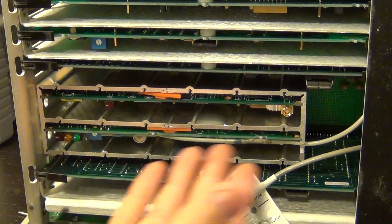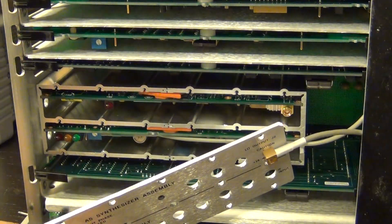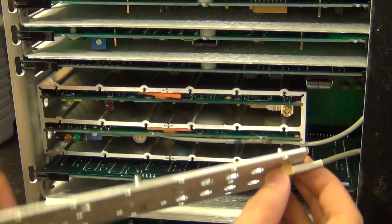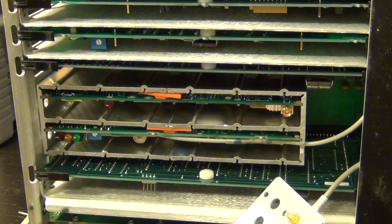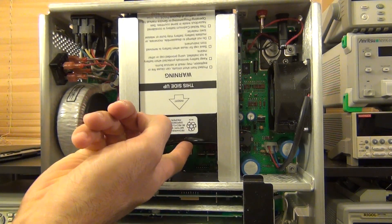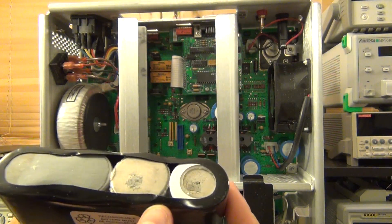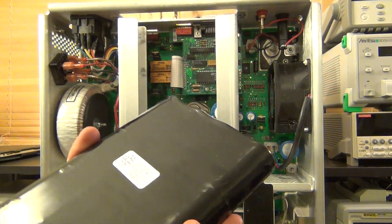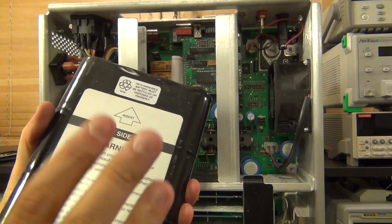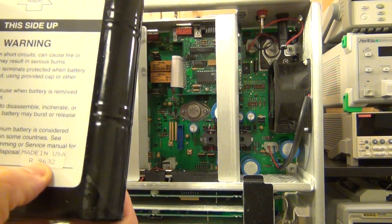The output of the VCO comes out here, goes into this IC — which is a differential pair — splitting the signal into two. One signal comes out here, goes into this amplifier which was that final stage with a heatsink, and the output goes out as the synthesizer output. The other side of the differential pair feeds back the signal. The signal goes through another transistor in common base configuration, its output taken out, and then goes all the way into a divider — which makes sense, because the synthesizer output is much higher than the reference frequency. The divider divides the signal, feeds it back into another divider, and that comes back into this IC. This IC is a full PLL — it has a lock detector, phase detector, and charge pump outputs. The charge pump output comes into an op-amp with two MOS transistors used as the charge pump, which switch current in and out, changing the voltage on the varactor and tuning it.